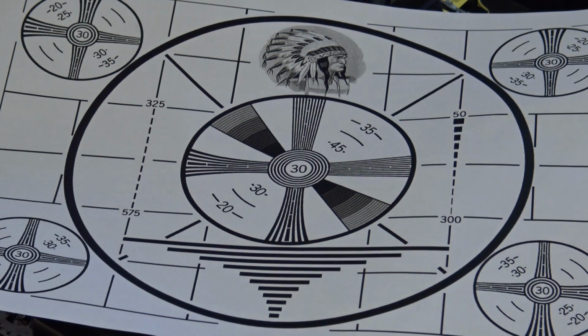Another type of monoscope generator was one that was actually at the first shop that I worked at when I was still in high school. The owner had a flying spot generator, and basically what it was, a black and white picture tube that just displayed a solid white raster, right? It was just a television sync generator that generated horizontal and vertical sync, and it generated a solid white raster on a screen.